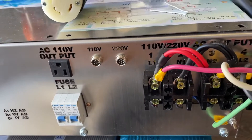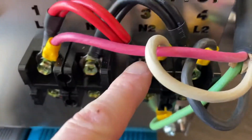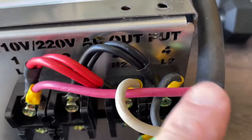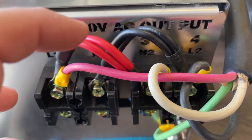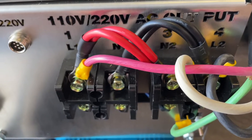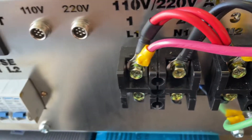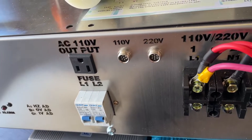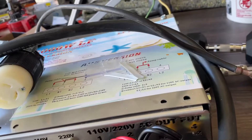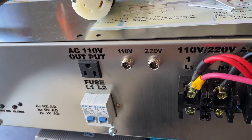As I thought about this a little more, I figured I'd give this one last try — setting it up for 120-volt only at 6,000 watts. I went back to the original configuration where one goes to three and two goes to four, so the coils are in parallel instead of in series. Perhaps this would give me more starting amps or surge amps. I figured I'd give this one last test, connecting it up to the generator — I'm not going to try the battery. I think the generator will actually be able to supply what it needs.